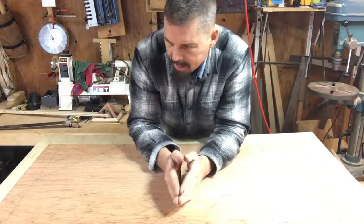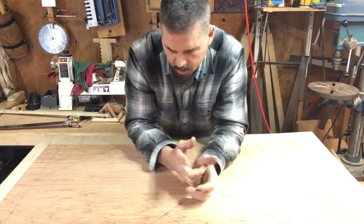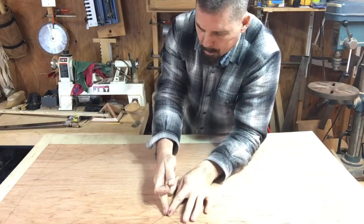So in this instance, 360 degrees divided by eight would give you a 45-degree angle. But as a roof framer, we operate in right triangles, so we need to know the common rafter run, the hip run, and the plate length between them.